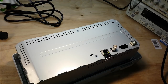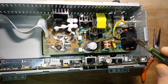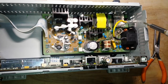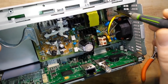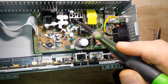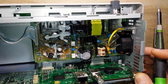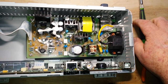We've got the top shielding cover off. You can see the universal power input over here and grounding directly to the chassis. Down in here we've got a MOV, which is very nice. Power switch, a fuse, another MOV — looks like good protection here. All these components are siliconed in so nothing is bouncing around. Very nice job with the power supply.